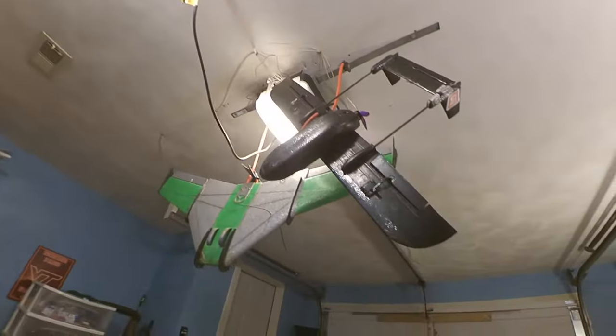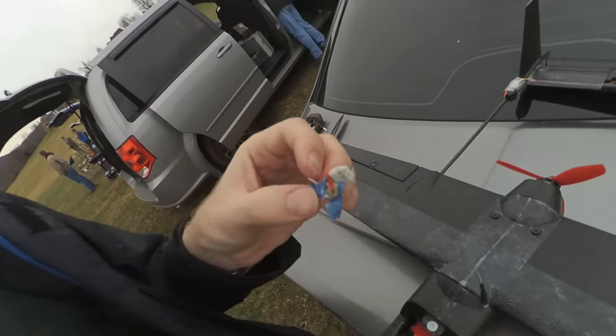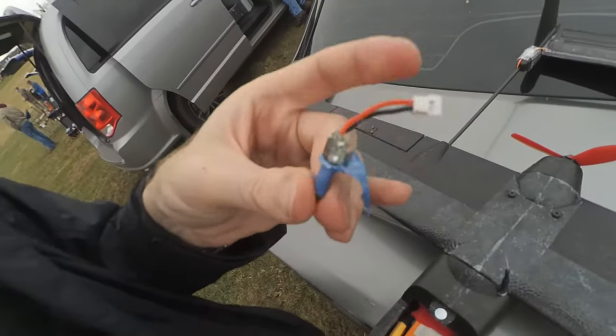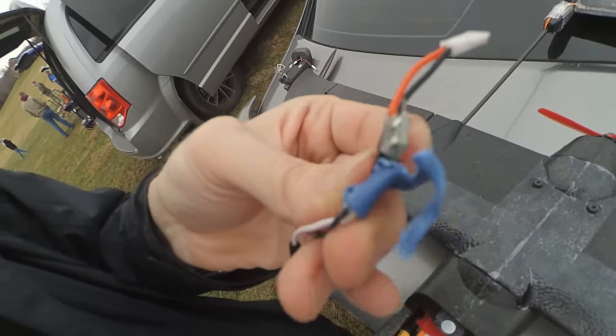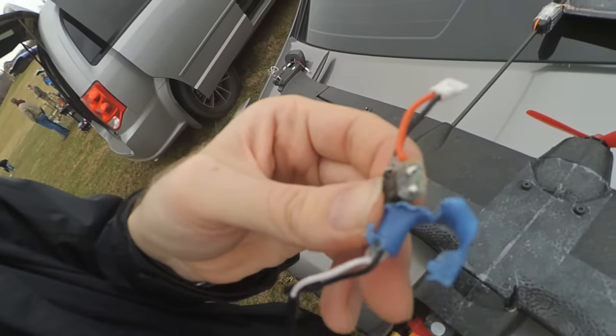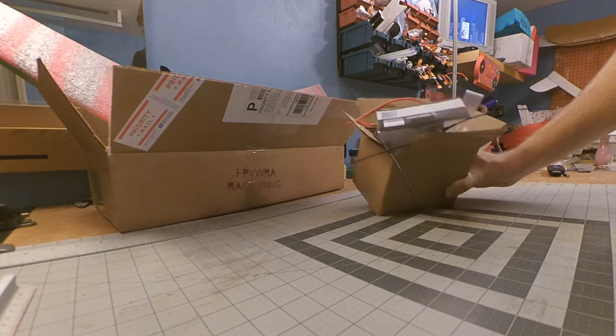I've got the Nano Sky Hunter. That one's working again. You can see that up here. I reattached the broken boom section on it and got a little bit more laminate where it needed it, and fixed the voltage regulator that I was using. I noticed the camera wasn't powering on, so I checked it and the ground connection that plugs into the lipo had come undone.